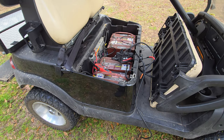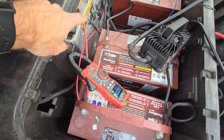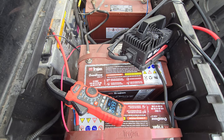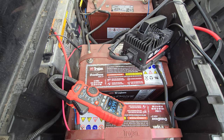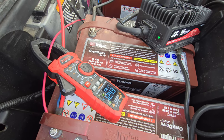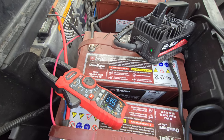We're going to show you what the actual amp draw of this thing is. It's a 48-volt 15-amp charger. I have my amp meter right here — it's plugged in to the positive line where the charger port comes in. We've plugged it in, it's going to do its thing and poll your batteries to see what kind of charging they need, then kick on and start charging. You can see the green light is blinking, meaning it's charging, and you can see the amps rising on the amp meter — that's how much it's sending to the battery. Right now it's only sending 12.5 amps. This is a smart charger — it knows what amperage your batteries need to top off.